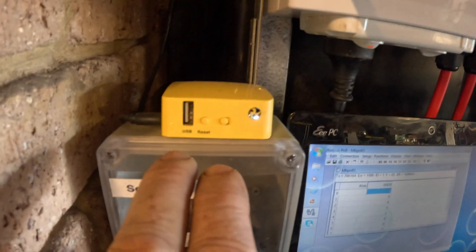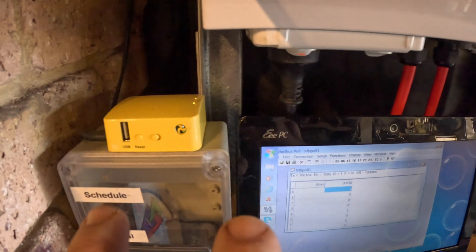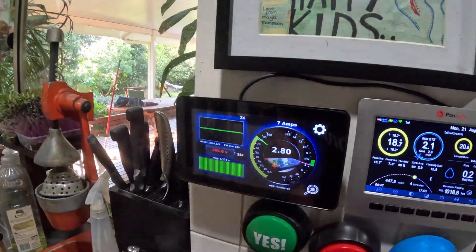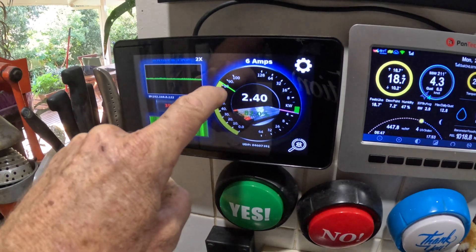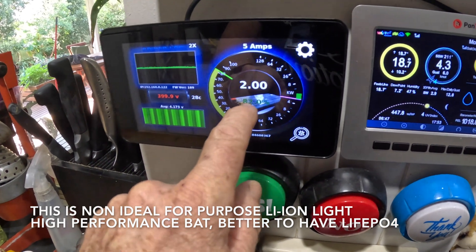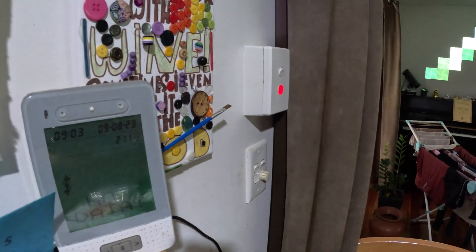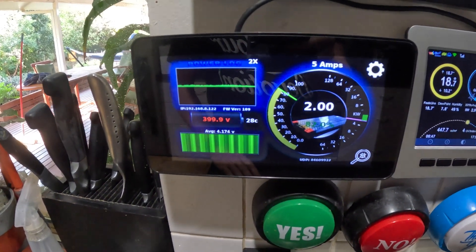From the 12 volts I'm also making 5 volts with this little power supply converter, which runs a small Wi-Fi router giving a display inside the house so I can see power flow and battery level. This is the EV TV controller. Currently it's 2 p.m., I'm still generating lots of solar and I'm almost up to 90%. I don't want to charge more than 90% because it reduces the battery's longevity. I'm currently charging at 2.0 kilowatts even though the chargers are outputting about 9 kilowatts.